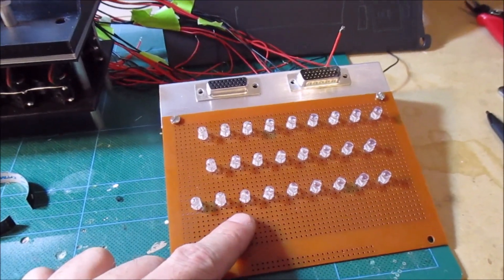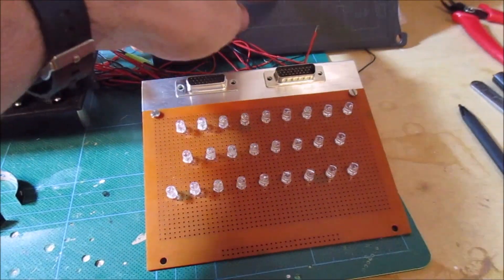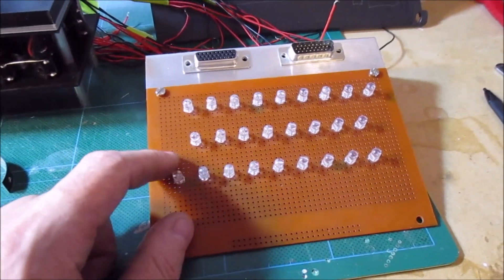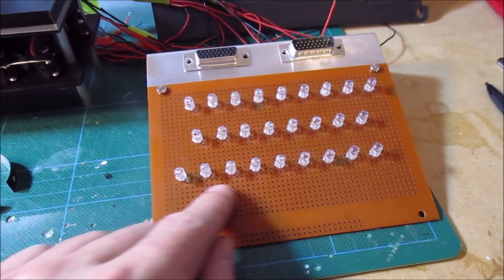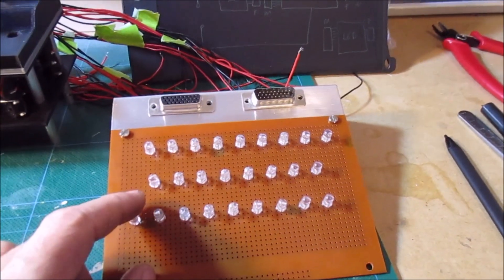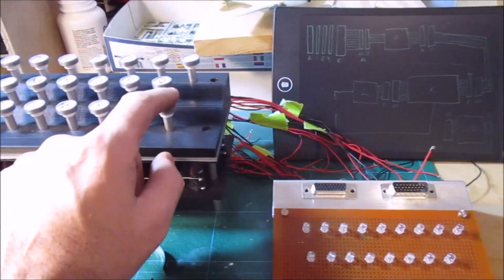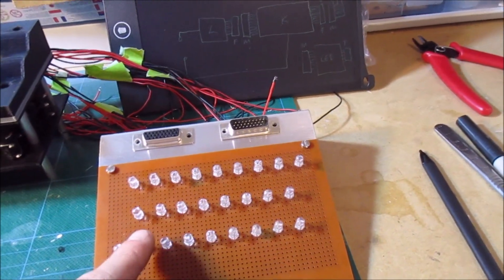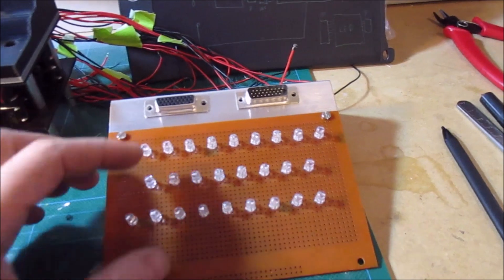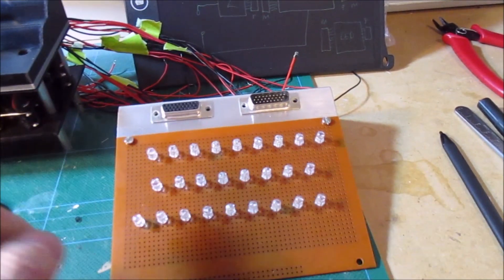This thing is going to be a little test jig so I want to be able to test all the wiring and check that I've got the connections correct. These connections can be broken and then plugged into this — these are actually bi-directional LEDs, sort of red-green LEDs. I can't finish it at the moment because I didn't have enough resistors, but basically these letters will match the letters of the alphabet on the keyboard, and with this plugged in series I should be able to press a key and see the power going in and coming back out by lighting up two LEDs — one red and one green. I'll probably also make a test jig for wiring up the rotors to check that the cross-wiring is correct.